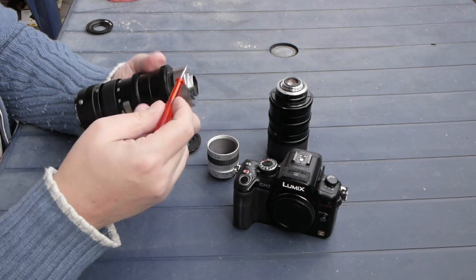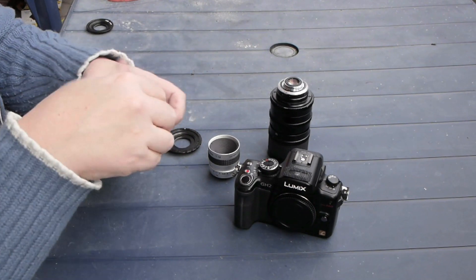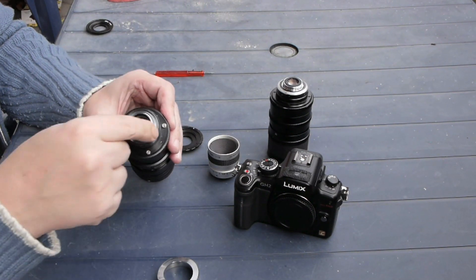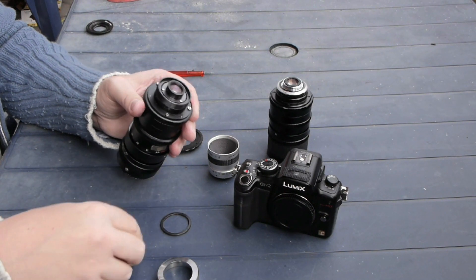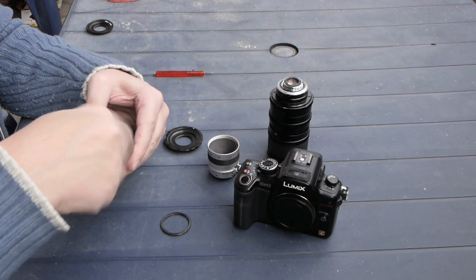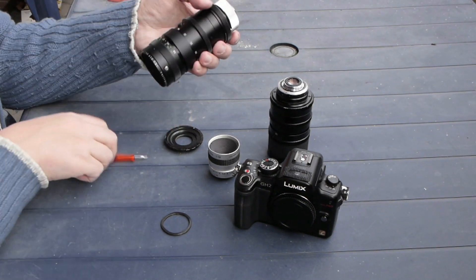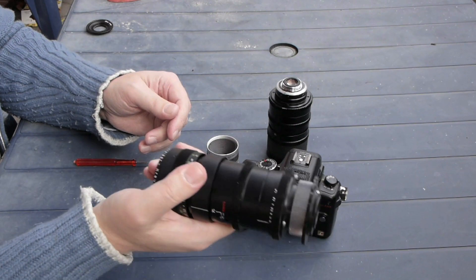You just need a little screwdriver — go right into this tiny screw here, loosen it a bit, and then you can take off this part and here is the C-mount. You can take off the C-mount and remove this distance ring. Without the distance ring, put it back, tighten it up with the screwdriver, and if you now put on the adapter, it will go deep enough.